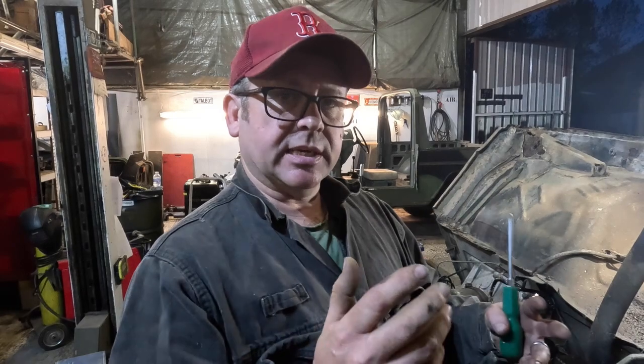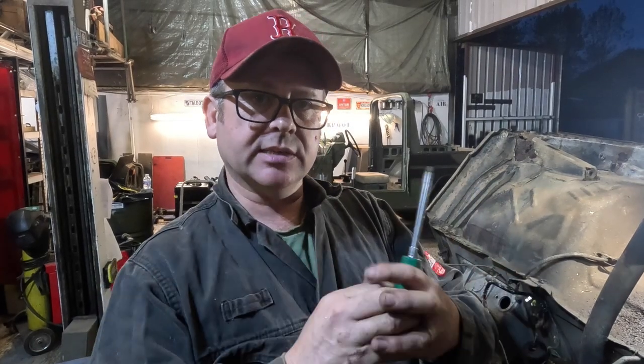Why did it get so bad? I think that the coating that was placed on the bottom of the vehicle was an excellent idea at the time, but over the years it's just held moisture against the body and rotted it out. Where did that moisture come from? The majority of it would have come from above, because these vehicles have canvas roofs and doors. Water's always getting in. Some of them were used without the roofs, etc. And that all fed down through the sides of the vehicles and gathered in these outriggers.